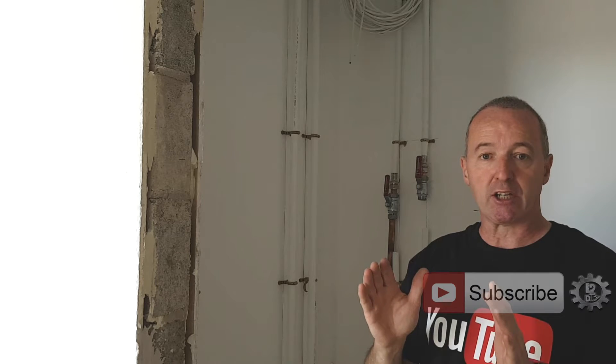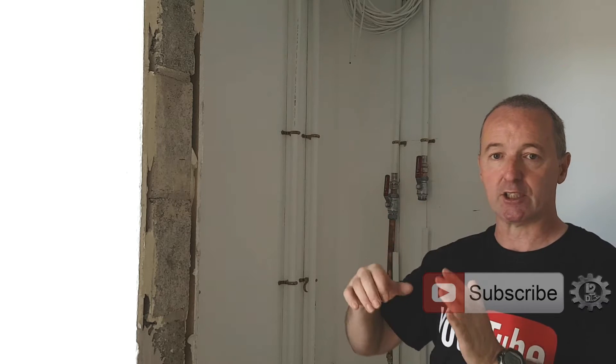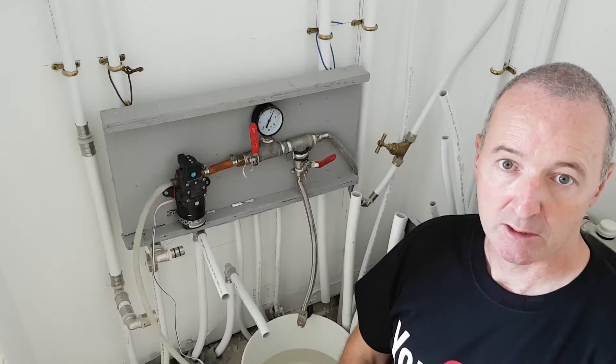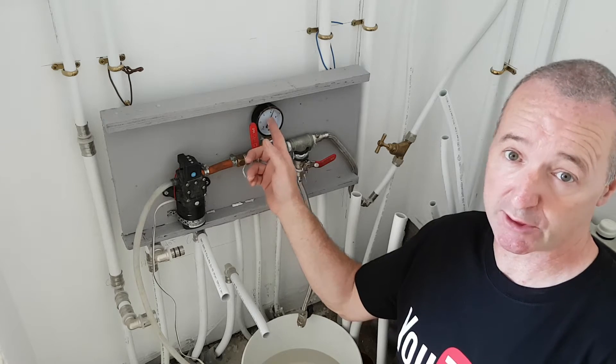So now we're relying on our two valves, which I know to be good. I've set pressure in and then locked it off, and now I'm watching it on a gauge. If it holds on that gauge for 15 minutes at high pressure — 6 bar is high pressure — that's great. I know it's not super high pressure, but for a domestic situation here in Ireland it's actually very good. These pipes will only ever see 3 bar, so I'm like 100% beyond that.